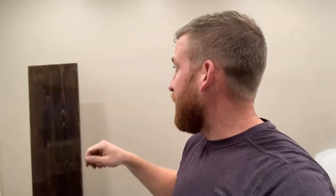So it'll smell a little polyurethane-y in here tomorrow, but we'll open the doors and blow all the fumes out. You'll see I put it on nice and thick, and then also I stood it up and ran the brush up and down in here. That way any of the drips, there won't be any runs in it that I have to sand out later. There's always a few. So that's gonna look good. And again, remember this is probably just temporary, but we want it to look good, and we'll screw it down on top of this until we get the rest of the room finished, and then we'll move on.